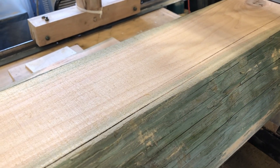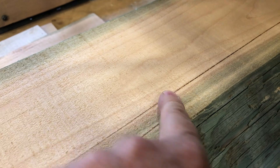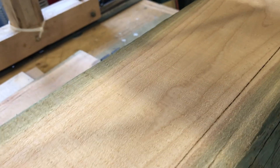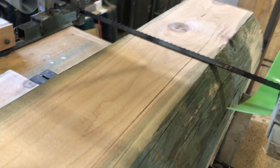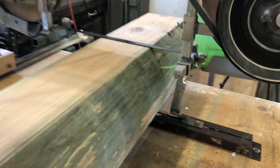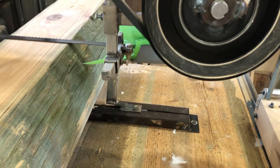With those new blade guides installed, I'm a little more confident in the cut. This is where the cut had ended previously, and on this side of the cut the wood is a little rougher than on that side — not a lot, but just a little bit — indicating there's a little more oscillation on this end, so the blade guides are making an improvement. We'll keep cutting up this log; I'll continue on with this tomorrow. My little clamp on the dust collection modification didn't hold, so I have to come up with a better way to do that. But it's always an improvement, and a build in progress.